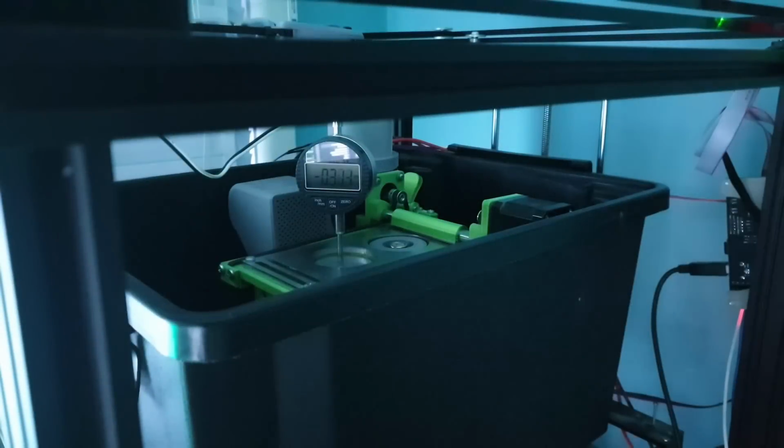Here I'm stepping in 30 micrometer steps, and you can see the movements tend to wander back and forth. This is due to a bit of bad design on my part, as I used the weld seam of the bores to locate the pistons. These have slight variances in them, and since the lead of the ball screw is 4mm, each tenth of a degree translates to a micrometer of movement.